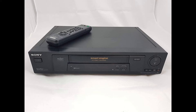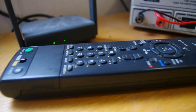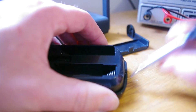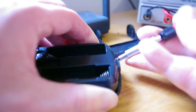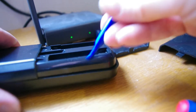I won't do the very basics. Of course you can check whether the IR LED is illuminating using most cameras on your mobile phone. You can check your batteries and other obvious things. If the LED isn't illuminating then it's a pretty good indicator that you either have bad batteries, dry joints somewhere on the board — these things are dropped regularly — or the contacts on the back of the buttons are dirty or need replacing. First thing we do is disassemble the remote. One video I saw online said it's impossible to do this without destroying the plastic — you just need a suitable tool. This remote requires a screwdriver to start opening the case, but once the bottom is released you can use a tool or a credit card to go around the edge and unclip the remaining sections.